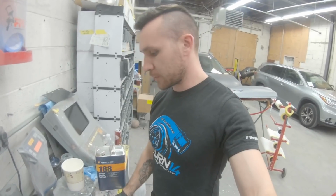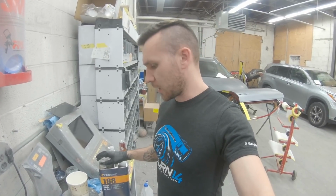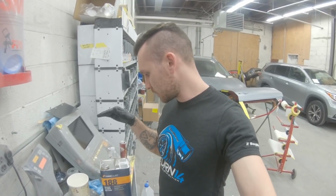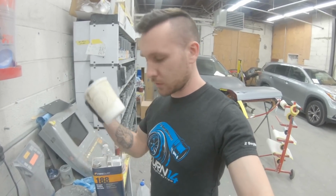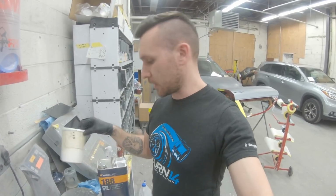The hardener is mixed into the gel coat at a ratio of 1.5 to 2.5%. It's about 70 degrees in here right now, so I'm going to be right in the middle, shoot for 2%. And after you're done mixing in this cup, we'll throw the lid on it, and then it just becomes a spray gun from there. So we'll see that in a second.